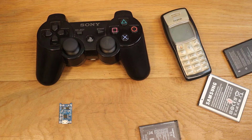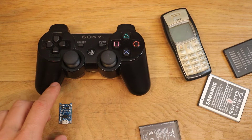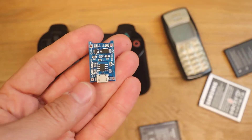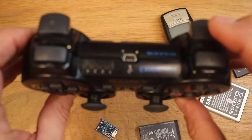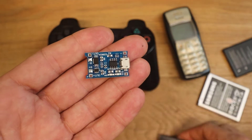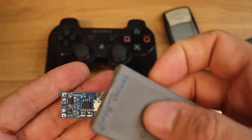At this point I see two possibilities: hack the PCB in order to enable the charger even without the handshaking, or use an external charger. This also provides higher current and micro USB, because I don't like the mini USB on the controller. Since the current is higher, you will also need a bigger battery, otherwise you may exceed the current limit for the original battery which is 700mA.